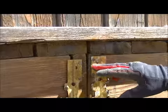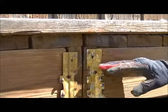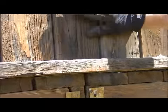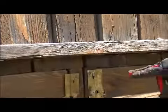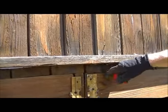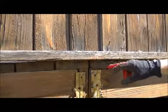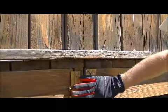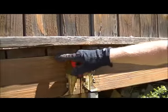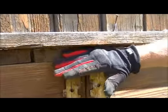The problem I was talking about: these are the beams, these are the joists, and you can see here that the joist is lower than the beam. We have a privacy fence on top of the deck, so rather than take the whole deck off, we got one screw out that was screwed into the deck but we can't get the other screw out. So what we're going to do is cut across here to cut this screw, and since we also can't get to the screws holding the deck down onto the structure, we're going to run the sawzall in between right where my finger is and cut these four screws — one, two, three, four. You can't see them but they're there. Now we can take these out and address the height problem.